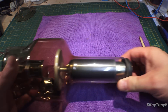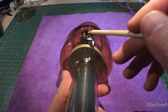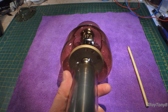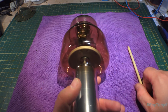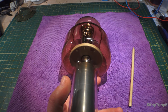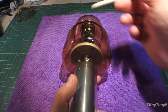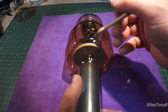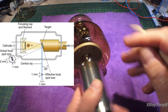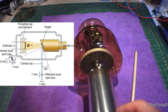As we saw in video one, there are two filaments or two cathodes — this is a dual cathode tube. The reason you need two cathodes is they are two different sizes. Whenever you heat that filament and apply that voltage between anode and cathode, that electron cloud starts to move towards the anode and forms a spot on the anode. We call that the focal spot. We often refer to our filament as our focus. X-rays are used to take pictures, so some of the terminology we use is photographic — like 'focus.'